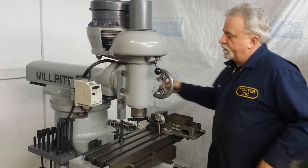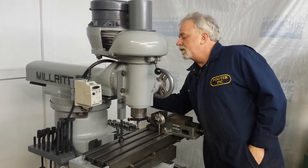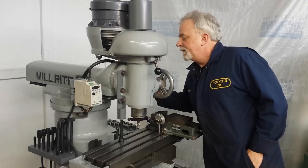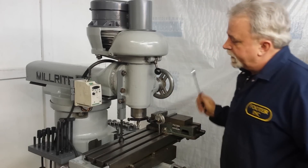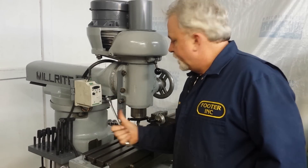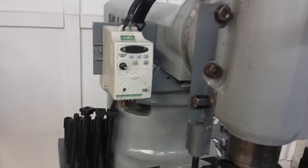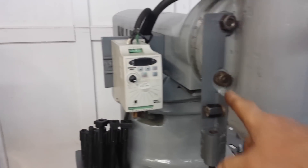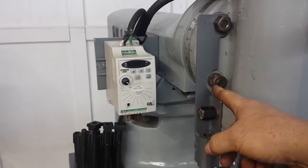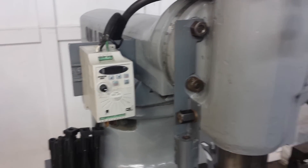Anyway, that's a good way to control the head — it makes the tramming-in process safer, not only for you but for your equipment, and gives you a degree of control and accuracy that's very hard to match without using a bracket like this. I'll get a quick close-up of the bracket. I notched this out so we have one more stud to lock it down as we're running.